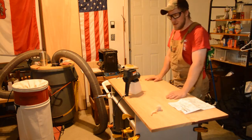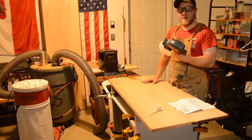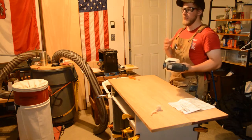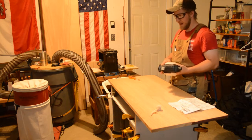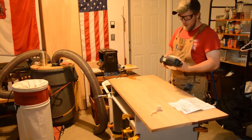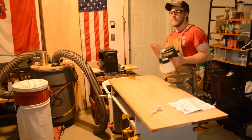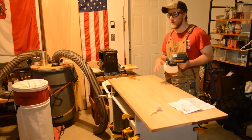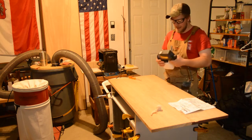What happened was after I stopped filming that day, I was literally about to throw this paint sprayer in the trash. But instead I took it apart and did what I normally do — I tried to fix it. I took the time to oil it correctly and free the piston, which I had to do with a hammer and a chisel, and now it works. So the nice thing is that I showed you how to do the painting technique without a paint sprayer. My goal for the next video is actually to show you how to paint the rest of this dresser — the remaining coats — with a paint sprayer, with all the correct techniques.